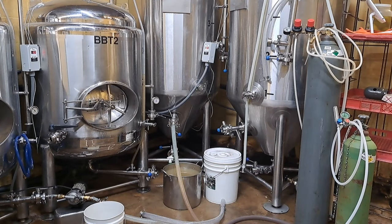I forgot I had that cooling down — that's a mistake, don't ever do that future brewers. I'll explain: I had closed the blow-off valve to this tank and crashed it. When you crash a tank — meaning you cool it down — the gases and liquids inside will contract and it will pull a vacuum on the tank. If you don't have pressure relief or vacuum relief valves on the tank, it can implode the tank. So it's pretty standard in the industry to never pull liquid out of a closed tank or crash a closed tank without pressure on it — just a little learning lesson.